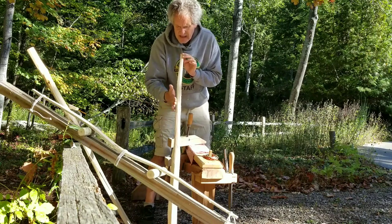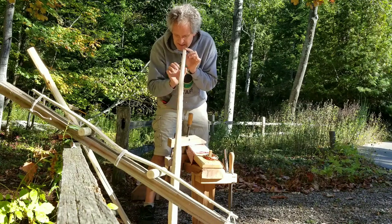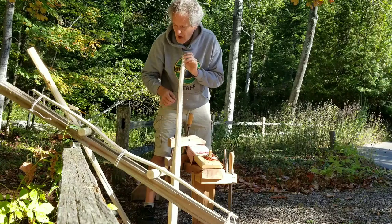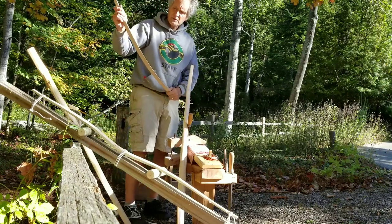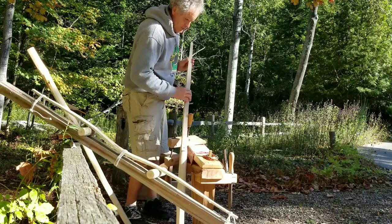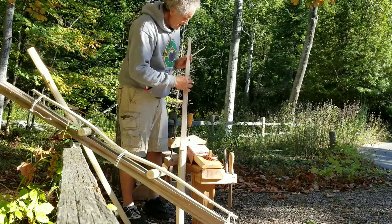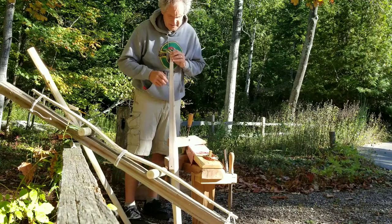And then just following the fibers and tapering it by eye, noting any spots where it suddenly gets thinner or narrower and then thicker, and then resolving that, or else making a template. This is 1/4 inch plywood. I've got a bunch of these things, and then I can just figure out where I want it down here. I've got some leeway. It gets thicker as it goes down here, so I can adjust it this way and just mark it following the waves.